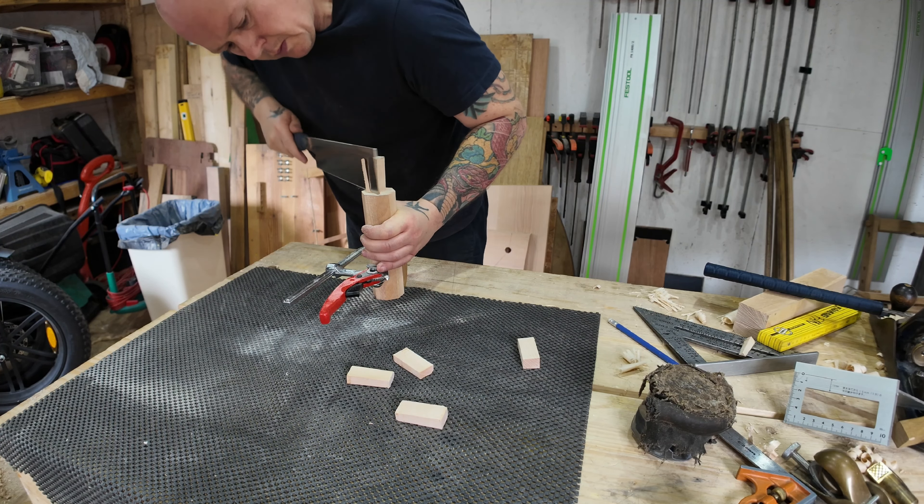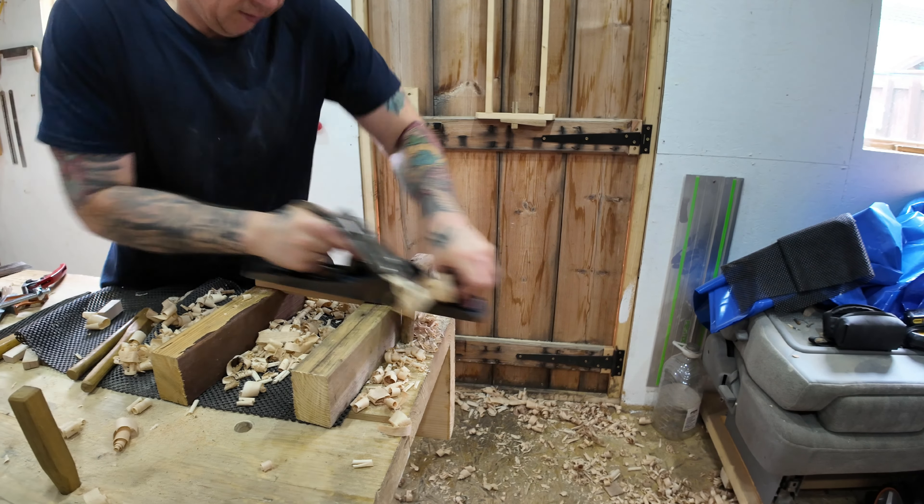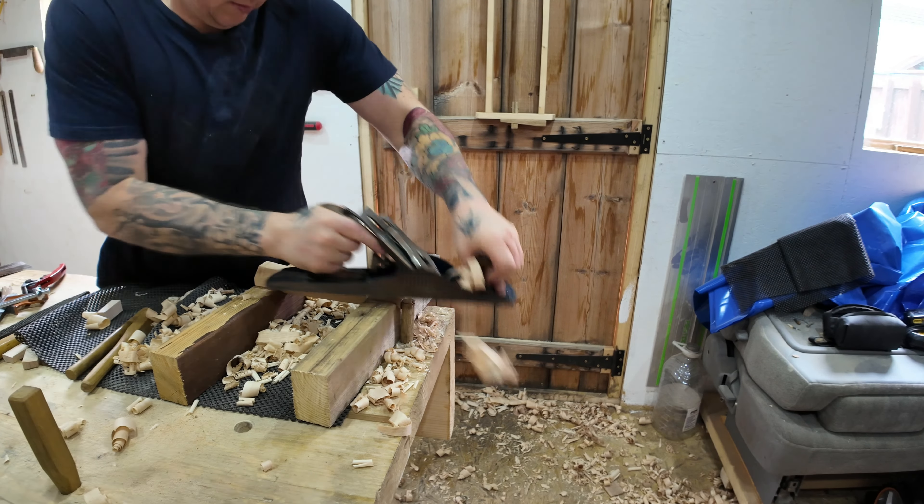Shaping the handle took a really, really long time. If you don't want to spend as much time, you could just square it down and it would still be usable, but I had an idea in my head and went with it. Once I'd removed some of the corner material, I started cutting for the tenons. I took my time with this section especially, because I didn't want to weaken the shaft — going round and round carefully so I didn't cut into the shaft that's going to be left.